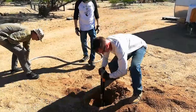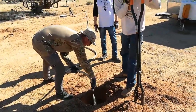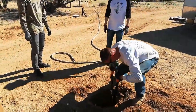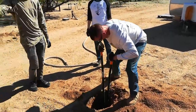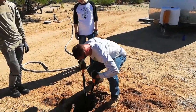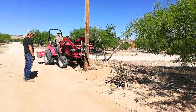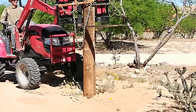As soon as it was in, we realized the hole wasn't deep enough. So we had to take out probably another six or eight inches of sandy soil, and that's what you're seeing us do right here. This is Taylor — he's new to the neighborhood, and he and his wife Melissa are looking to also buy property and homestead. He was here helping out today and we really appreciate that. The soil doesn't want to come out too easily using a hand post hole digger because it's so sandy. The trick is really just adding more water to it and keeping it as wet as possible — that allows it to stick together and the tool becomes a little more useful. And the other nice thing about having several people around is you can tag in and out, and one person doesn't have to kill themselves doing this kind of work.